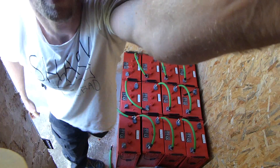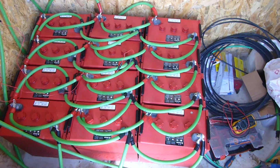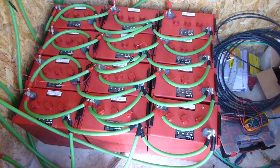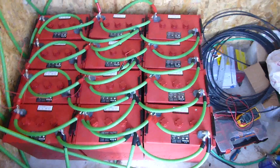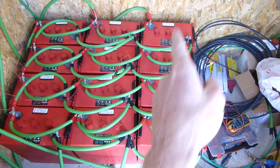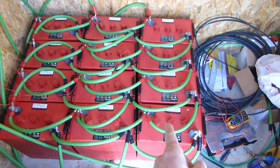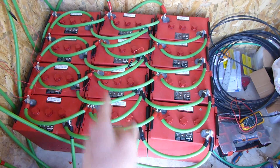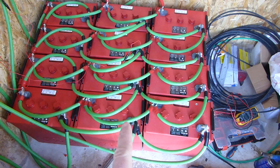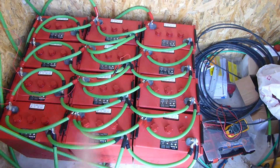So now I'm going to have to figure this little bit out. Here's the battery bank all wired up. I did make a video — or I thought I was recording a video of me wiring all of this up — but it seems I'd run out of battery. So these are three strings running in series. These four six-volt batteries are running in series to make 24 volts, these are running in series to make 24 volts, and these are running in series to make 24 volts, and then I've collected them all in parallel to make one big battery.